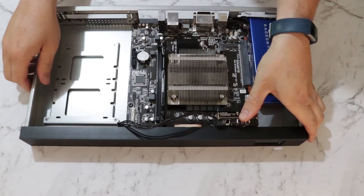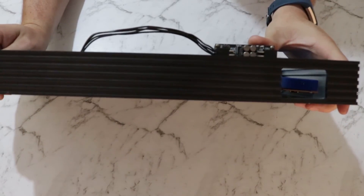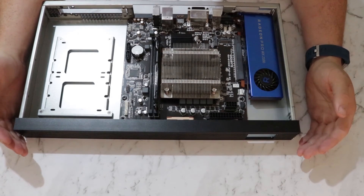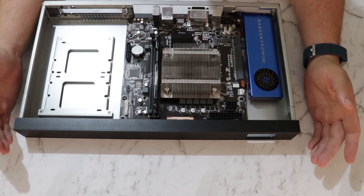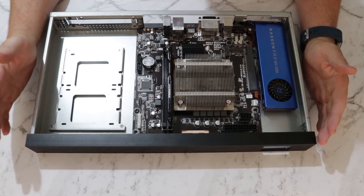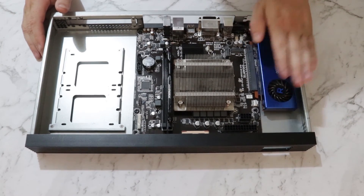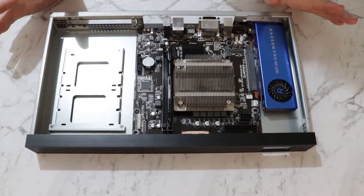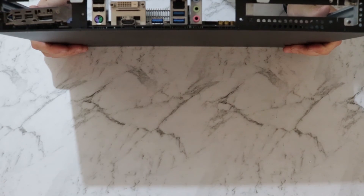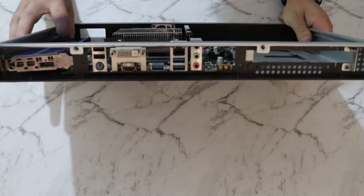The Compact DC unit is too tall for 1U, but an ATX extension cable routed through the chassis will be fine. The whole system will consume less than about 70 watts total, so I'm not overly concerned about power supply options. This will eventually be rack mounted in my rack, which I'll show in a future video once it's tidied up. The loudest component will probably be the graphics card, and it's pretty quiet — I was using it in a mild gaming system previously. One thing to note: in 1U systems the I/O slot is non-standard; I'm probably not going to put an I/O shield in — the extra venting is worth it.